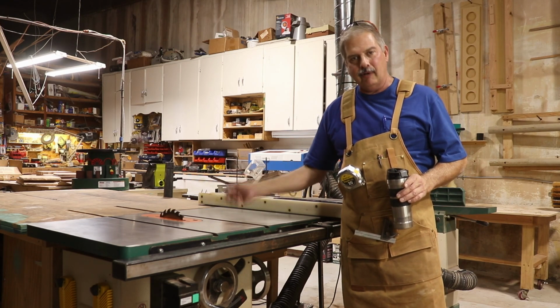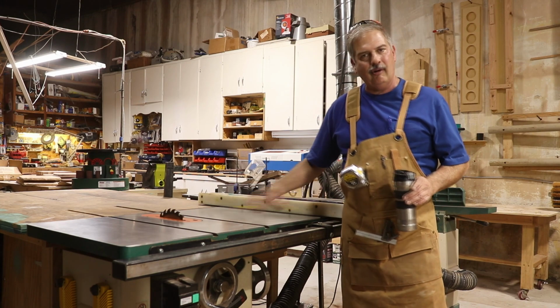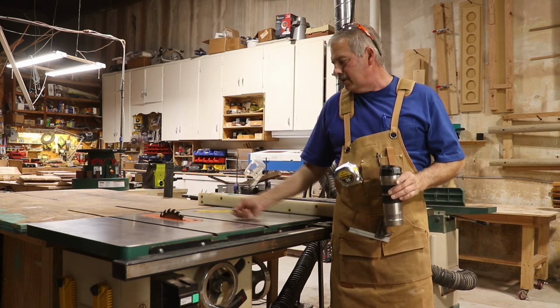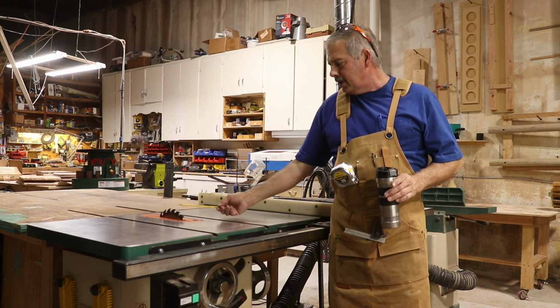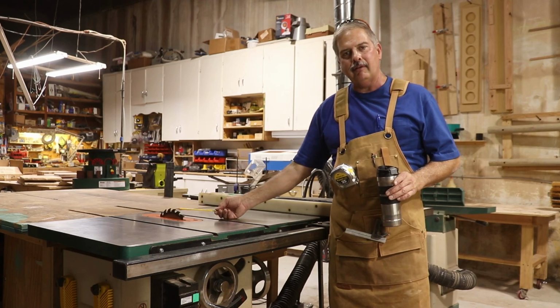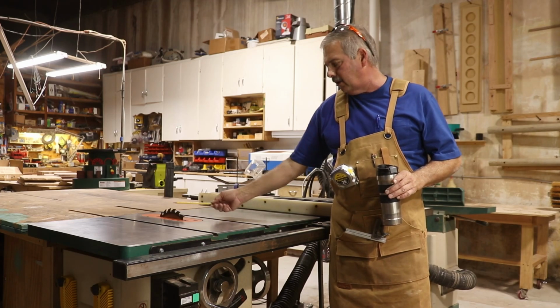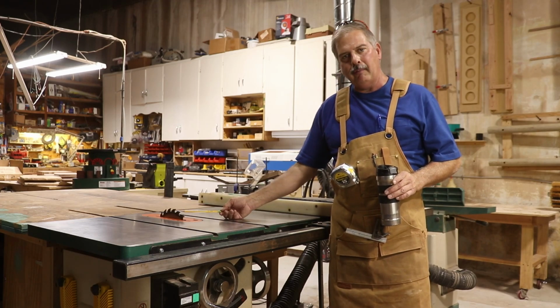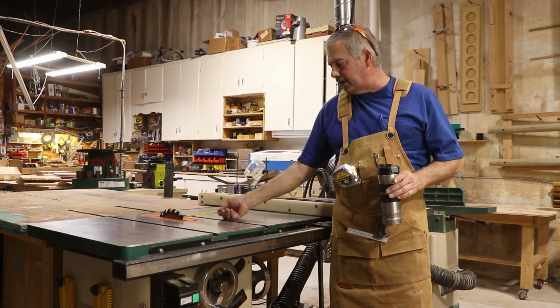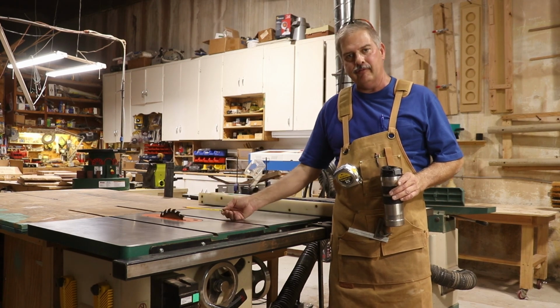This blade is a rip blade. That's all it is for. That's all we use it for. It's a very heavy, about 1/8 of an inch thick blade, real heavy carbide teeth, and the bevel is a dual ground on one tooth and a flat bevel, flat tooth behind it, and it alternates. It's about a 40 tooth blade. We also have stabilizers on it. You can't see down in there, so this blade will not move.